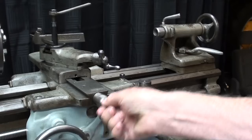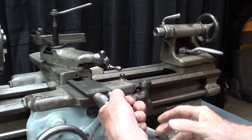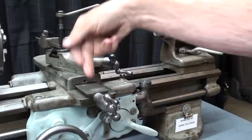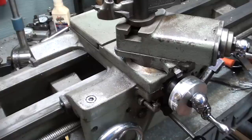If you are using power cross feed and feeding away from you, at some point the screw runs off the brass nut and nothing more will happen — there will be no damage. To re-engage it, you pull back on the cross slide and the nut and screw will re-engage. Some machines have that same protection when feeding toward you as well, though this machine does not seem to have that. Let's step into the other shop and see how Atlas Craftsman and Clausing protect their machines from a crash.